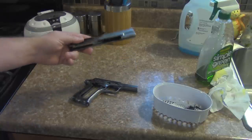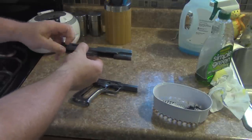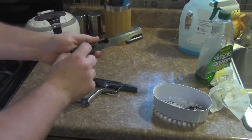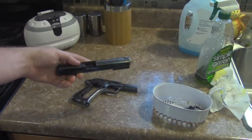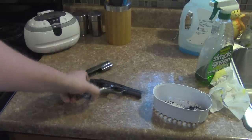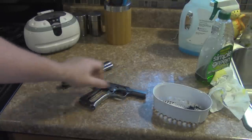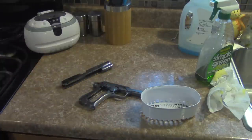This is actually a Star Super B. I've taken it apart, I've taken all the springs and anything that shouldn't get blued out. Because obviously if you heat up your springs, they're no longer going to be springy. So I've gotten it all apart. As you can see it's got some blue on the side, but parts of the frame and the front of the grip are completely virgin — there's no finish left. I put everything through the ultrasonic cleaner and then used some Simple Green to get all the grease off.